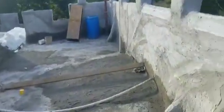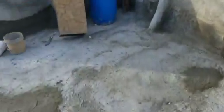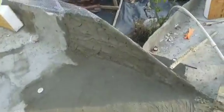So by the end of the day on Tuesday, I got this second piece of lath up there and more anchored in over here. So now that mortar piece is actually touching on the bottom. It's not quite touching on that corner, but more coverage there. And then most of the second batch went onto the ground or the floor here, trying to help the slope, which is pretty close, but it's not finished. And a lot of it went on the sidewalls, tying in the remesh as well. And then I got basically full coverage on this piece right here, as well as some decent coverage on this side.